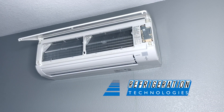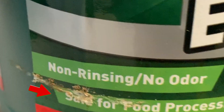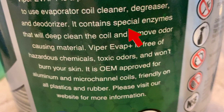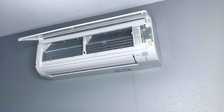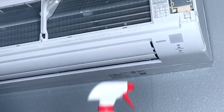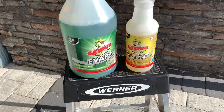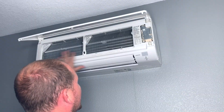What I've found that works really well is a couple of products from Refrigeration Technologies. To treat the evaporator coil, we use Evap Plus — it requires no rinsing, it's completely safe, and it's enzyme-based so it works on those live organisms. Then on the drain pan and the very last row of fins we use Viper Pan and Drain Treatment. Because neither of them are toxic, they don't interact negatively with one another, so you can use them both.